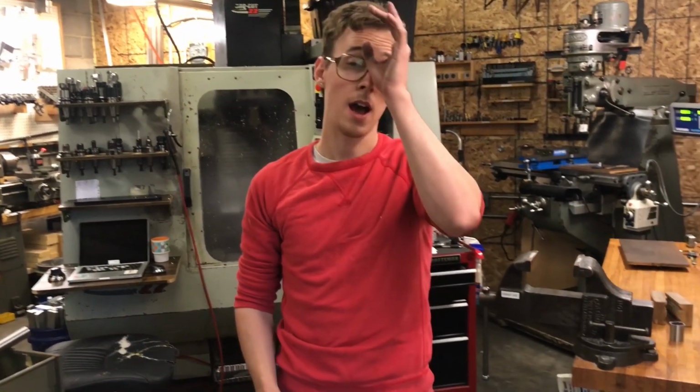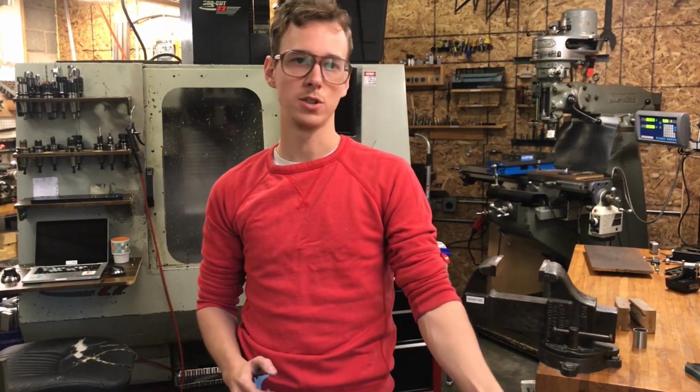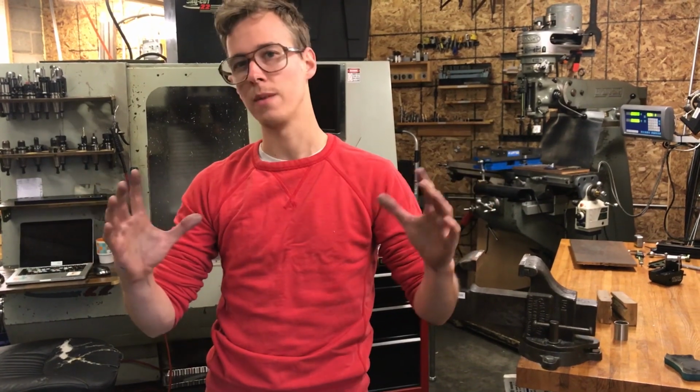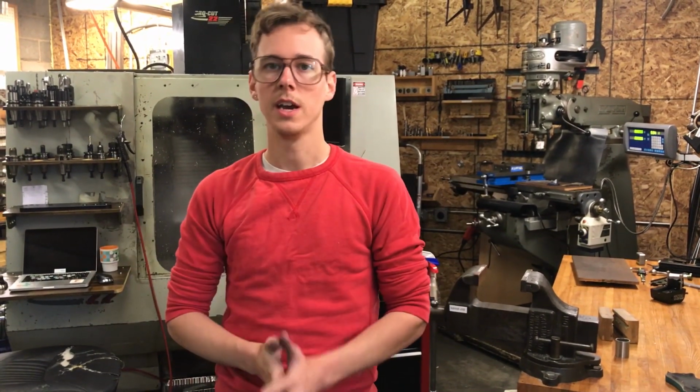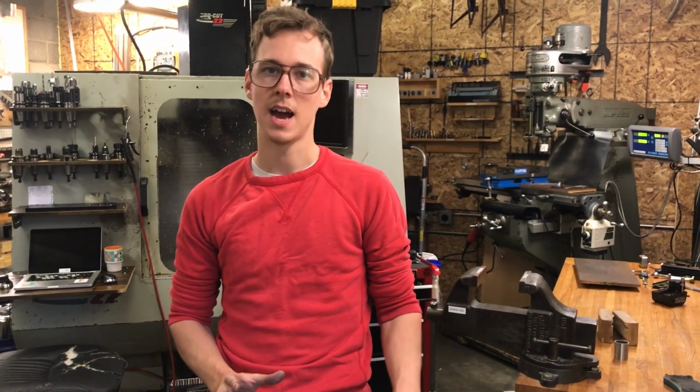This works, but it's smart to kind of sneak up on your number. If you overshoot it by 2 or 3 millimeters, you don't want to weld a gap that big by any means. You could tweak your frame fixture in just a little bit shorter, and your bike would basically ride the same way. But I would like to not have to do that.